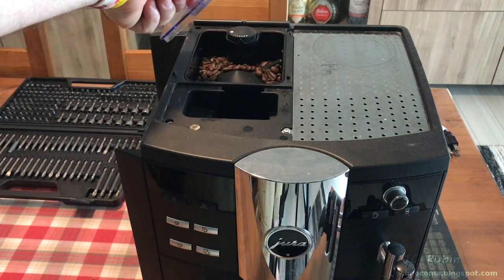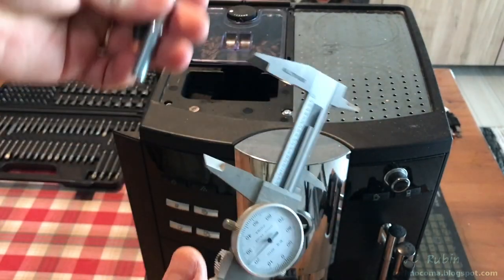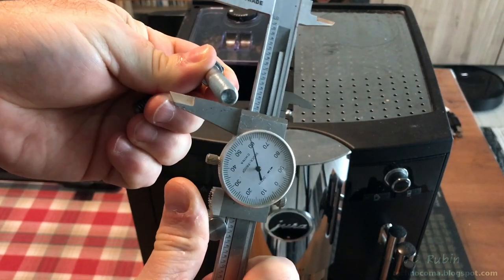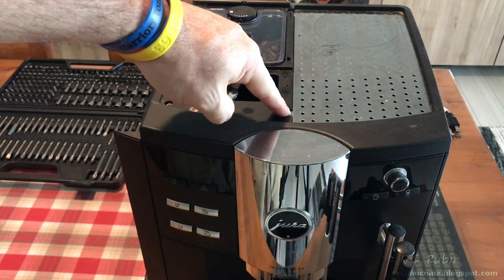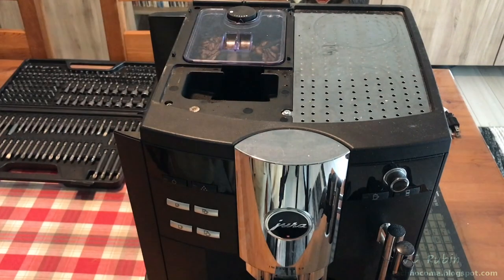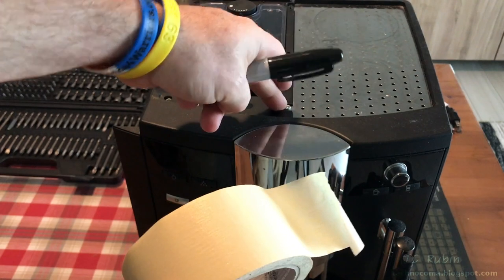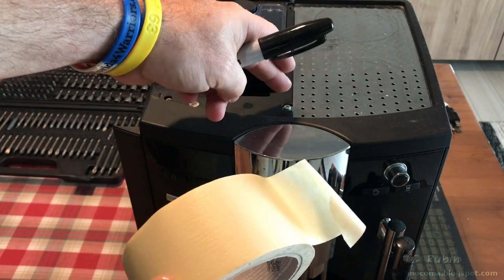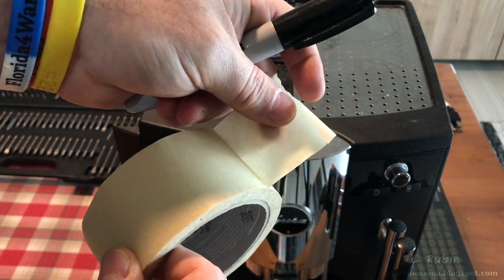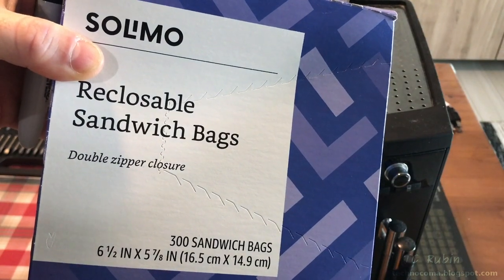When I work on bikes and motorcycles I have big bolts and it's easy to figure out their sizes with a caliper — I don't think it'll be that easy on this machine, and there are a lot of screws. So I'm going to tape and number each screw as I remove it in this video, calling it out as I go. That way I'll know not only which one went where, but in what order I removed it, and I can store all the screws in a sandwich bag.